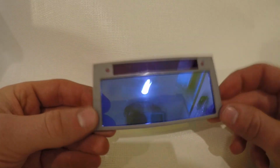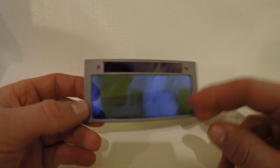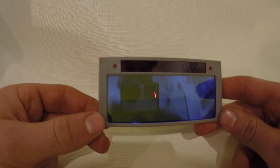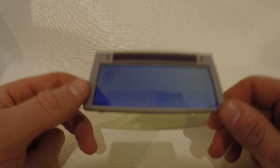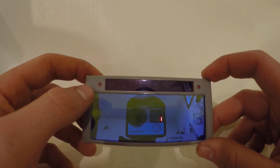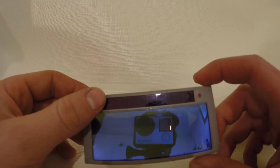I've used this lens for everything from TIG welding, MIG welding, gouging, stick welding, everything. What does it not do? This is shade 10, by the way. Does gouging, does the MIG, does the stick. TIG, absolutely worthless. This thing flashes the hell out of you. You cannot use this for TIG welding, at least this model, the Tradesman, because these sensors aren't sensitive enough to pick up the arc half the time, and I'm a Boilermaker, so I'm just learning to TIG weld now.